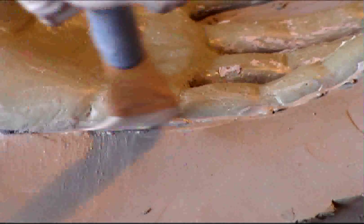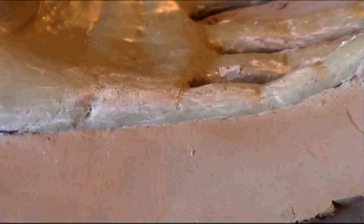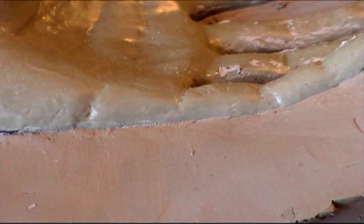Here's a bit of a trick. Use these flat brushes and wash away this edge — you want a nice right angle here, meeting up against the sculpture nice and crisp, like the letter L. When the edge of the sculpture meets the edge of the clay in a nice hard edge, that means that your seam line when you make your mold should, in theory, be almost invisible.